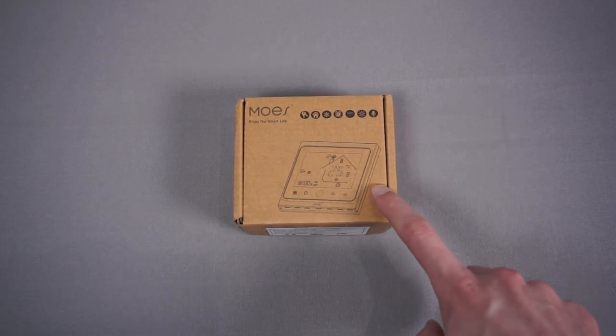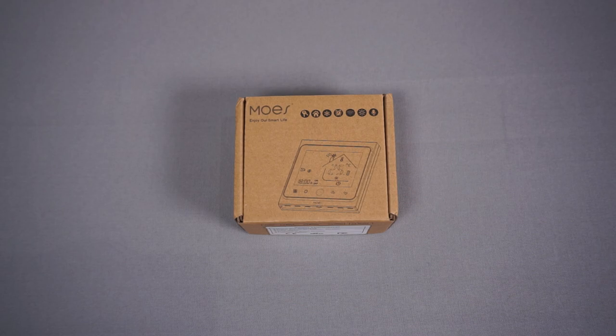As I mentioned in my previous video, a lot of my rationale is I don't want any cloud involvement or external manufacturer involvement. With the Wi-Fi version it's a Tuya smart device that talks out to Tuya servers. While it does have a local API, to get the credentials you need to register as a Tuya developer, adopt the device into the cloud environment, and get the credentials out — which I don't want. And while you can flash custom firmware onto Tuya devices, I really don't fancy doing that.